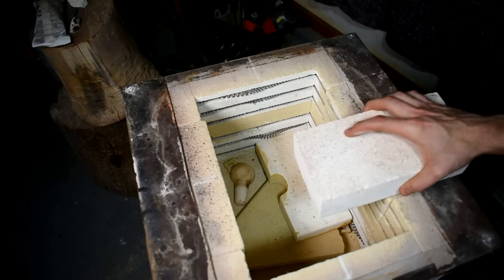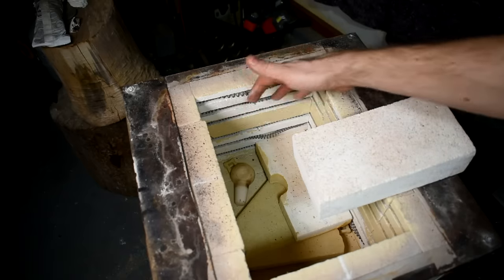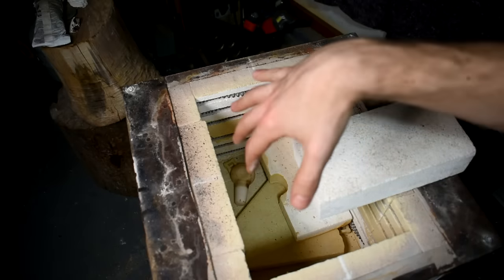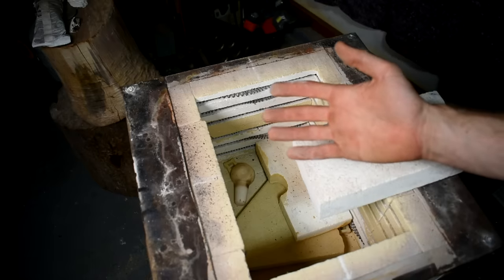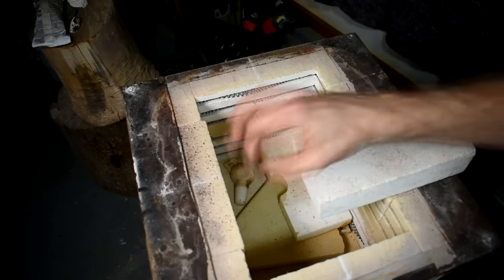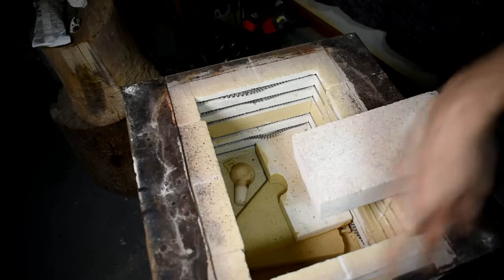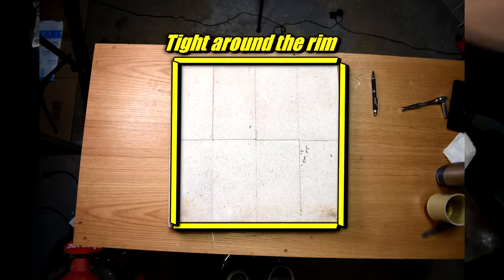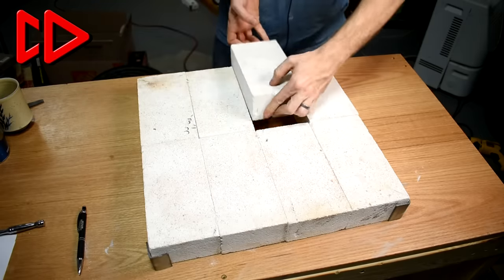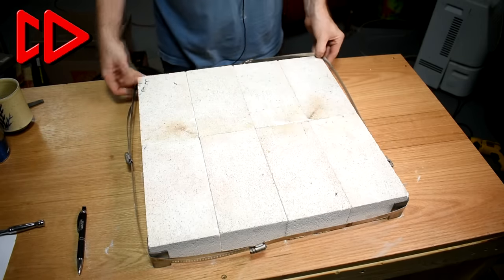Look at this from up here. When the bricks go on they kind of sit like this — only part of it is covering the opening, and in here is the hot chamber. This side of the brick gets exposed to all the burning heat, and out here it stays relatively cool. So that means the inside has shrunk a little bit and the outside hasn't, and this happens all the way around. So if I tighten the band clamp it just tightens along the perimeter, and the inside part is still all loose. I can confirm this by flipping the bricks so the loose part is on the outside and the tight part is in the middle, then re-tightening the clamp to see what happens.